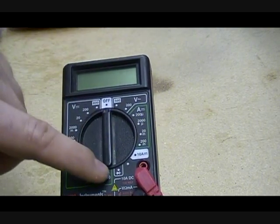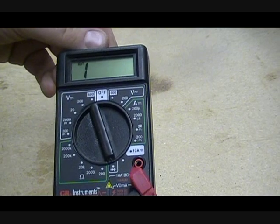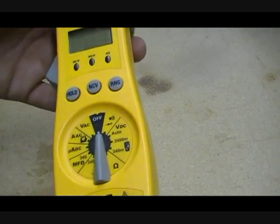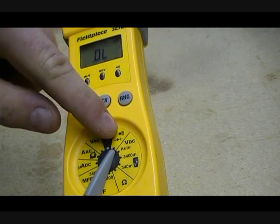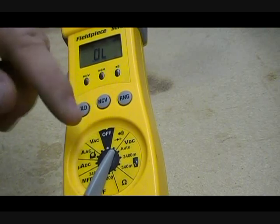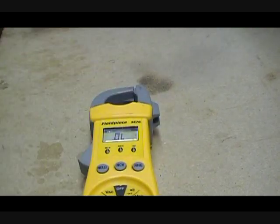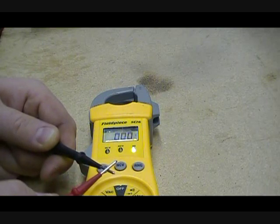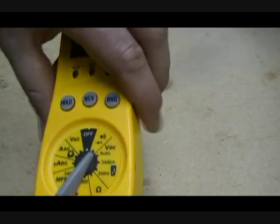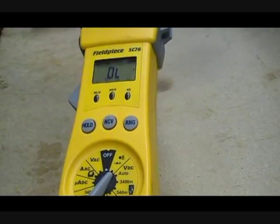What you're going to set this meter on is the little symbol that has a line with a triangle and another line — the continuity/diode setting. On the Fluke-style meter it would be one position over. This setting with the symbol and two lines means it has an audio tone, so whenever there is continuity through what you're checking and the circuit is closed, it will make a beep. As you can tell, both meters share that same symbol: a line with a triangle and another line intersecting it.